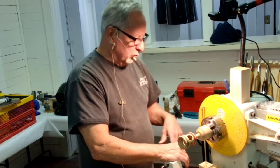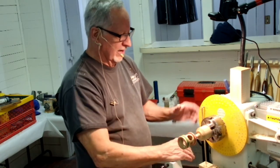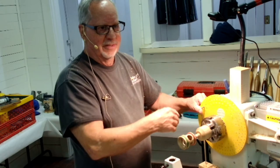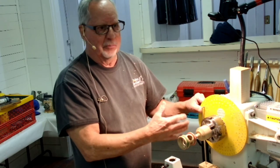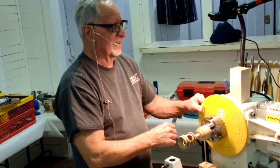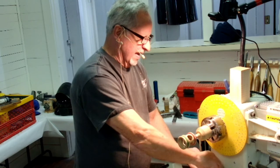My first index wheel didn't have any of these. It was just a round disc. I had an L-shaped block of wood on here, and I would simply clamp it. I'd already taken my dividers and divided off. When you want to do really odd numbers like 7 or 5 or 13, none of the index wheels have those numbers. So that's where that comes in handy. I can step it off with my dividers, and then all I'll do is line it up with the top of my dowel and clamp it, and I'm ready to make a jig. This one I came up with,